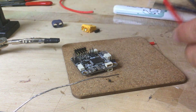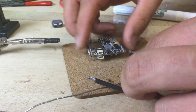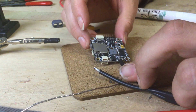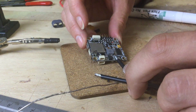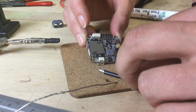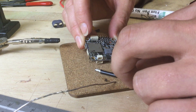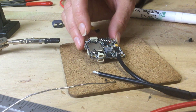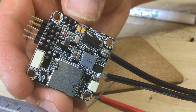Let's go and get the earth on the bottom of the board. It doesn't matter which one of those black wires you choose, as long as it is black. We're going to turn the board upside down and get that soldered onto the bottom of the board. Got the soldering iron again. I'll just tap on the camera so it goes into focus for you. I have already been in pre-tinned those tabs. Just waiting for the heat to get through. Can you pull that board up straight please? That's the connection which we've really got — that's on the ground pad.